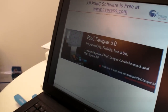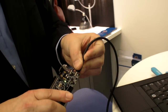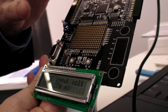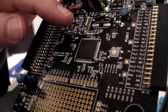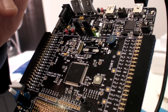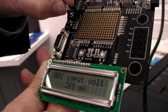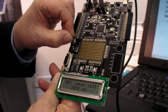So we'll go over here by our University Alliance area. Now this board is powered up and basically it's just doing a very simple demo. We're taking the line voltage, running it through this potentiometer here. It goes into the PSOC where it goes through an ADC, and then there's an algorithm that the ARM Cortex M3 does, which basically turns the readings from the potentiometer into a voltage. And that comes out on the LCD screen as I turn the potentiometer.